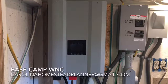A 3,000-watt system is what we use to take a well pump off, giving you about 28 amps — basic unit runs about $2,500. A 6,000-watt one is about $3,300 and puts out 50 amps, enough for a large travel trailer. The 12,000-watt system puts out 100 amps — if your house has 200-amp service, that's half the power of your house, so off-grid it'll pretty much run your house. From there it's just how many panels you have to feed it and how many batteries you have to store the power.